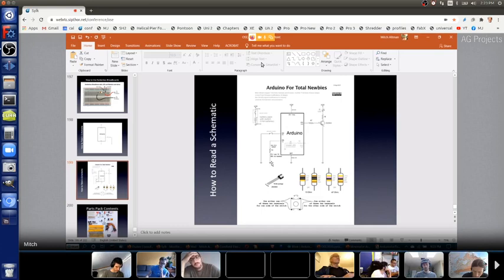Okay, so there's all these grounds. Usually they have grounds at the bottom, and here's two of these. Remember what this is? That's the red wire. Power. Okay, we got two of those. So we got a red wire to power our Arduino, and this goes to the 5V hole on my board. Some of them say VCC. And then the ground hole has my battery pack's black wire, and then the board can be powered.